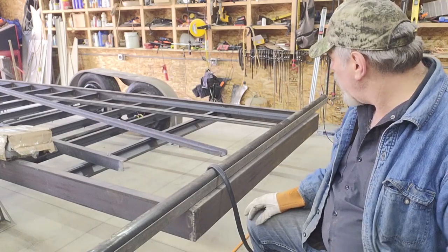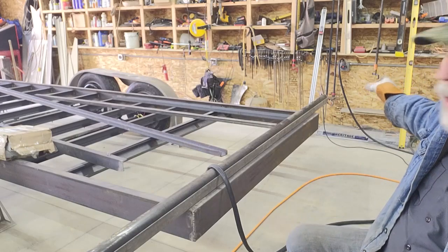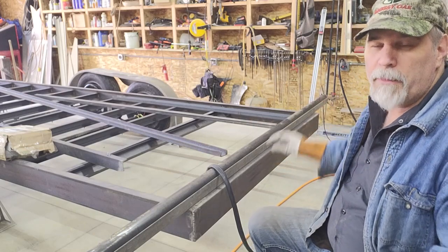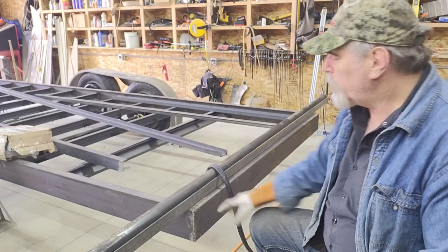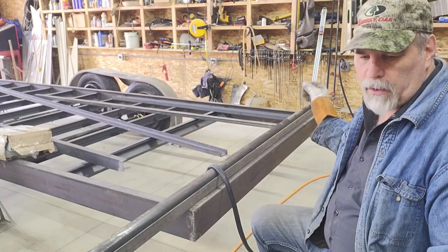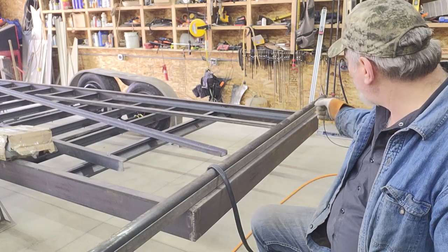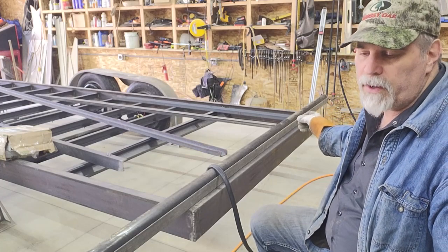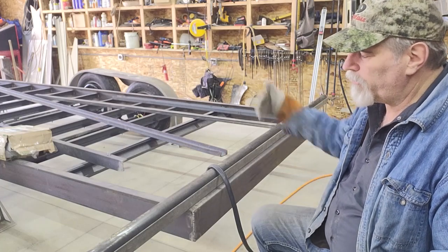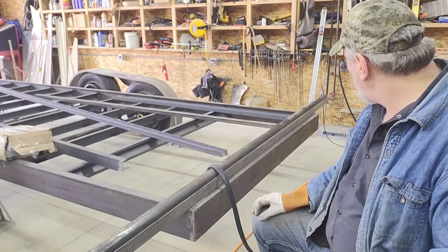I only need to go as far as the width needed, and I'll leave a scratch. I'm not going to start from the very end — I'm going to come in about a half inch or maybe even a quarter inch, make a plunge cut and then come down. That'll keep it locked in because depending on how much internal stress there is in this pipe, it's possible it'd try to open that gap up. By leaving that little piece on the end intact, that should combat that from happening. If I do see it opening up partway through, I may even stop, skip down a quarter inch, re-plunge cut, and come through — that way it holds it as close to perfectly round as possible for when I make the other two cuts.